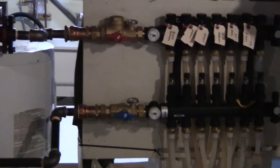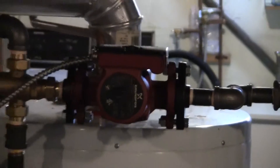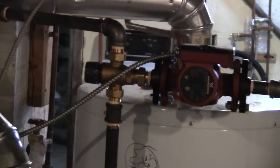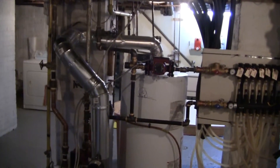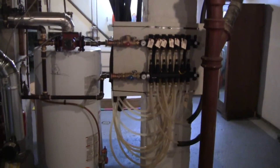We've got an isolation valve and shutoff valves here, a separate pump that circulates water through that system, and then we have a proportioning valve which is temperature-based. So while the main system that runs to the radiators may run at about 130–135 degrees, the water that comes into the underfloor heating will be about 110 degrees.